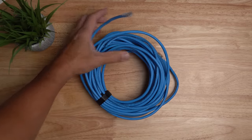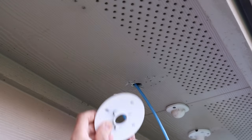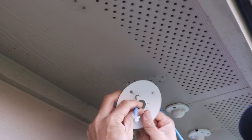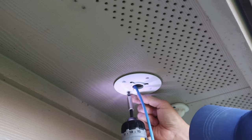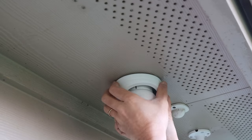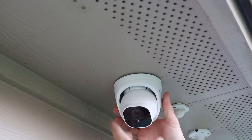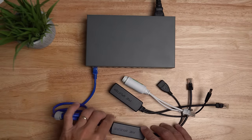The best wiring to set up your wired cameras is Ethernet or network wiring, because you can eventually upgrade to PoE or NVR cameras, which is still the best wired security camera setup — it's why businesses, banks, and casinos use them instead of Wi-Fi cameras. Dropping a Cat5e or Cat6 network cable in the outside corners of your house is a one-time investment. You can reuse the wiring with different PoE camera brands, and can also power Wi-Fi or USB powered cameras by adding a PoE splitter on the camera side and a PoE switch or injector on the other end.